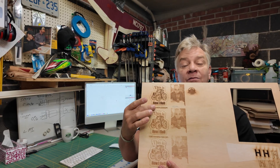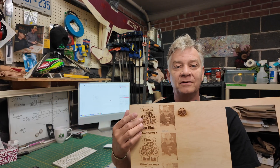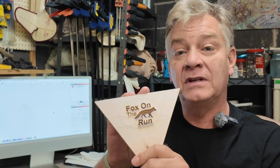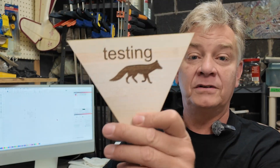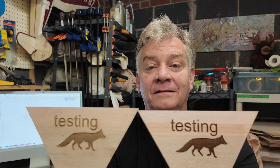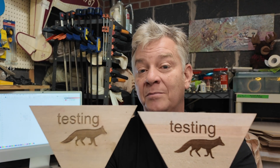Unlike the more or less surface engraves where all you had was a little bit of dust or soot or debris that you could easily sand off in 20 to 30 seconds, now you have a bit of work ahead of you. That resin is really hard to sand no matter what grit you use. What's worse is when you keep sanding at it trying to get not only the debris out of the wood grain but trying to sand that resin off your engrave — what started off looking beautiful ends up looking ruined because you've had to sand so much of that surface off.